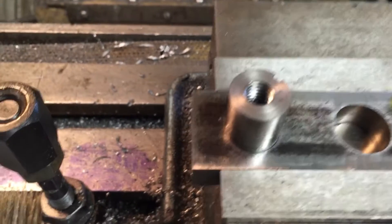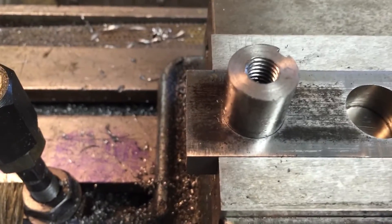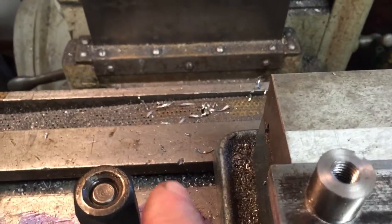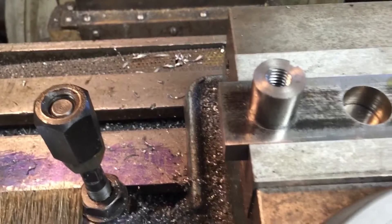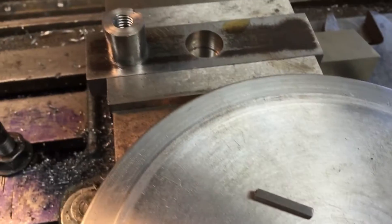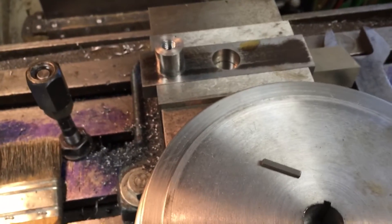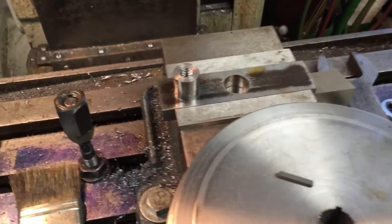It's not so much the 45 degrees exactly — it could be 46, it could be 44. It's just that every wheel has to be the same, so the two on one side will match up. Whatever they are, they'll match. The diameter away from the pin will be right. I've indexed the milling machine — it's an inch and three quarters over here to the center of the crank pin. So every wheel will be identical, indexed identically from the keyway in the wheel to where the pin is. So let's go ahead and set this in there and we'll run through boring it out for the crank pin.